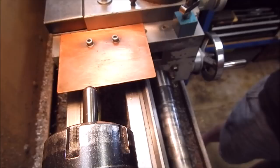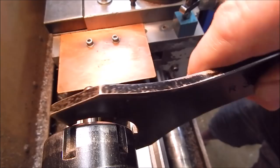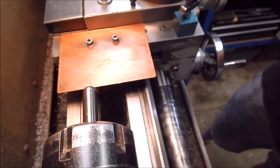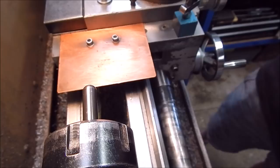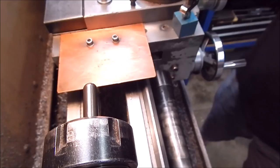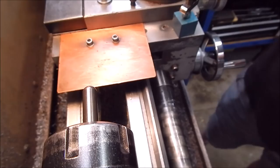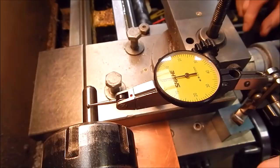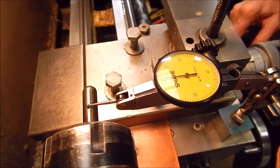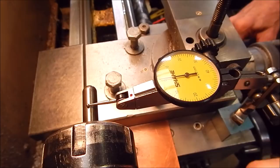What we'll do is undo the collet — that won't actually disturb the job. We'll back the collet right off, then get a screwdriver and put it in one of the slots and turn the collet 180 degrees. Now we'll do it up again and take our reading again. 0.06 — we've got a beat. And now we've got a lot better than 0.06, just by turning the collet round.